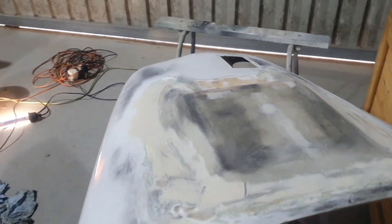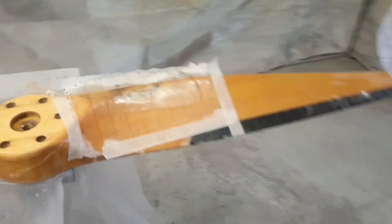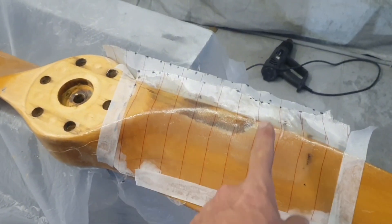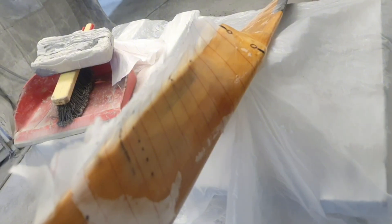Hopefully I can get that finished and painted today, and get the nose wheel painted too. We're currently repairing the propeller in here — I've got a little dust tent set up with epoxy resin, woven fiberglass, and peel ply on there. When we pull that off, we'll clean it up, blend it in, give it a coat of clear and it should come up well. Peel ply on the top as well.